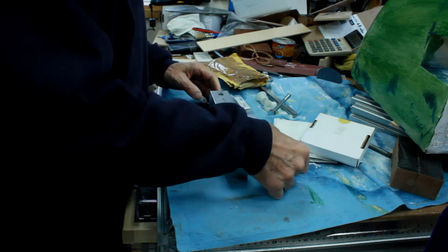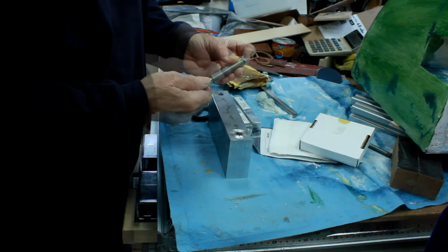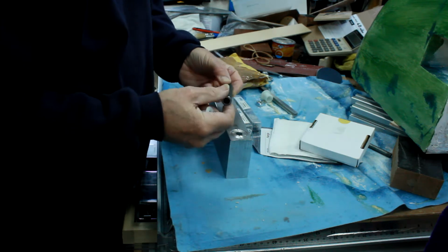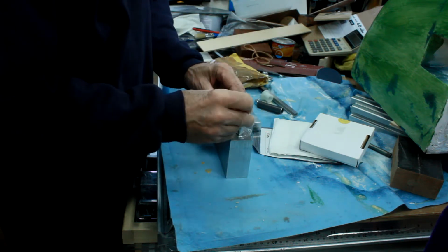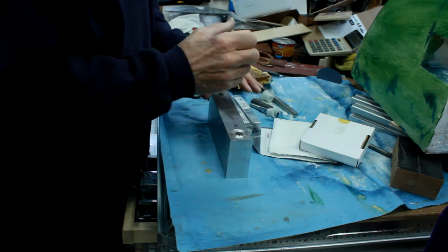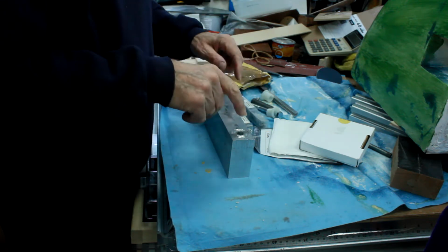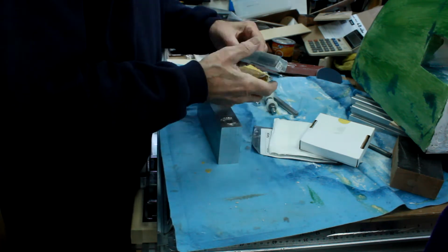So I've decided that the best thing to do is to reuse the original Gemini cart's sleeves and mount those in instead. This is a 16mm outer diameter tube, and if I just do a straight drill on that, it may get the same problem of being just slightly loose in there. So I've got a 15.5 to see if that would solve the problem. This is basically due to the inaccuracies of having a vertical pillar drill that's not very good. And then I can just take out the last 0.5mm without too much fuss, I think. So that's what those are for.